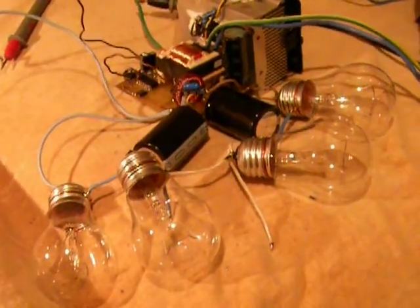And it seems it is. Here is the converter with the ferrite core recovered from an old ATX power supply from a computer, and the driver. Below the transformer you can see the rectifying diodes. I'm using a voltage doubling method to obtain high voltage for the anodic power supply. The heat sink is an ordinary heat sink from a Pentium 4 computer.